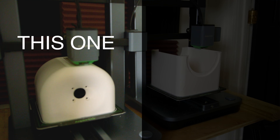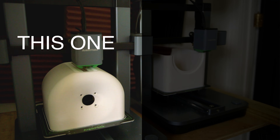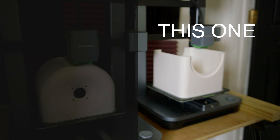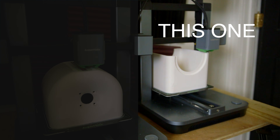Let's start with printing. You'll want to orient the hat — the top half of the speaker — with the open side down. Luckily, you don't have to print this with any supports. I would run the speed somewhere around 200 millimeters per second, with a wall thickness of four millimeters and an infill density of 30%. For the bottom half, print it with the open side facing up and the bottom of the speaker facing down — no supports, four millimeter wall thickness, and 30% infill. This should use a little under a kilogram of filament, and I'd print it somewhere in the ballpark of 170 to 200 millimeters per second. The slower you go, the higher quality the print will be, so if you want a really nice surface finish, slow it down — even 70 millimeters per second. Let these run for a day, come back, and you'll have your parts ready to assemble.